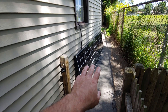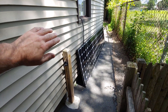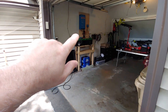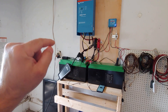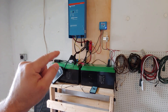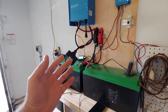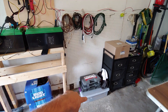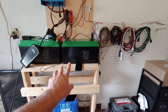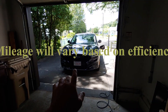I just have these two panels placed out here gathering whatever sun they can, coming into the garage and into my charger on that board. I put this together for a little redundancy for the house — if we lose power, I can run a critical loads panel in the basement with lights and the refrigerator. I have 5.1 kilowatt hours of storage here, plus another 1.4 in a homemade battery I'll add in parallel, giving me about 6.5 kilowatt hours total — enough to put about 15 to 20 miles of range into the car strictly from the sun.